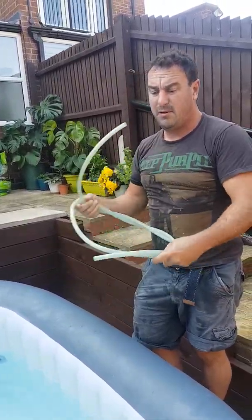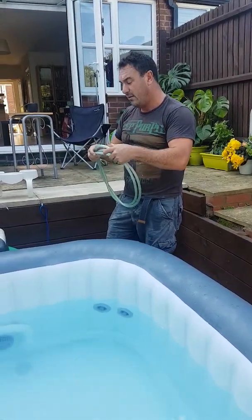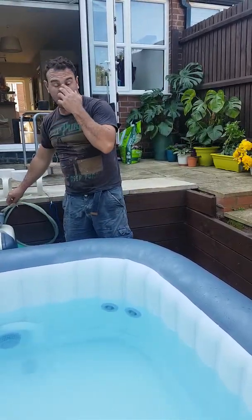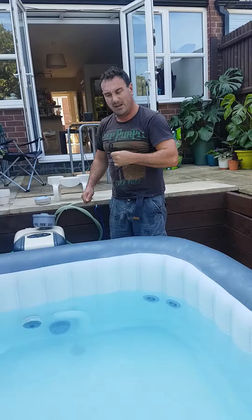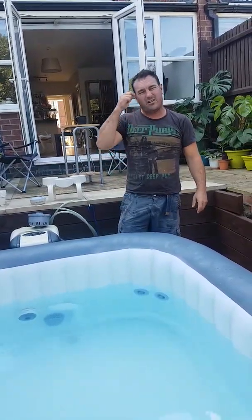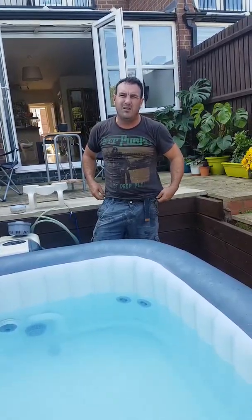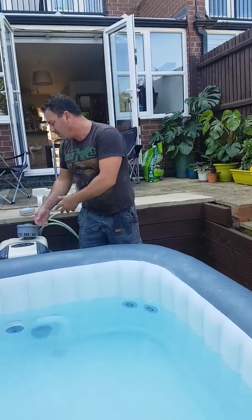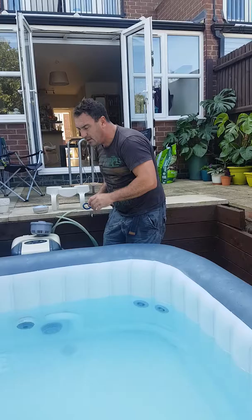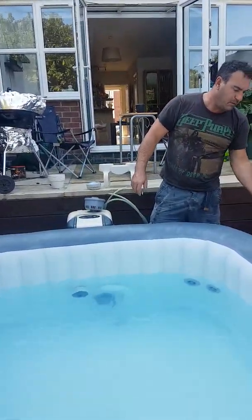You can keep to the regime of keeping the pool at a maximum level, but there's a high rate of evaporation if you keep this around 35-36 degrees — that's the optimum temperature. On the hottest day you probably want to go down to about 32. Keep it between 32 and 36 and that's fine. It's easy to clean, there's no trouble — you just got to keep maintaining it.